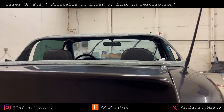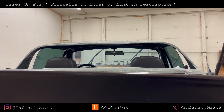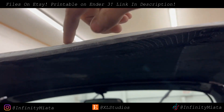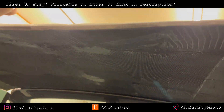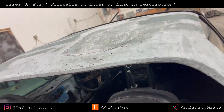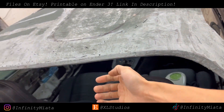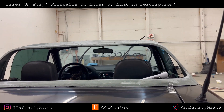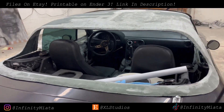Looking at this on video I'm definitely going to be cutting that one piece out — you can see it sagging right there. I'm going to cut it right here, all the way over here, and right back here — pull it out and put a new one in. I thought I'd be clever and use a heat gun to prop it up so I wouldn't have to putty as much. Don't do that — it's just horrible. No matter what you do, no matter how long you prop it up, it's always going to sag. That's just a mistake made along the way.